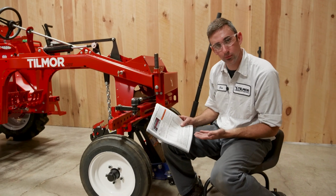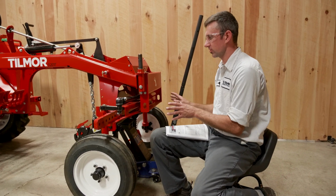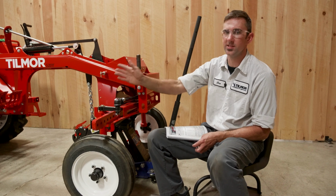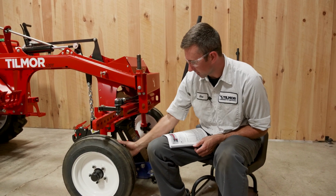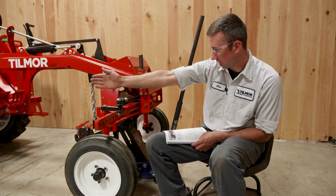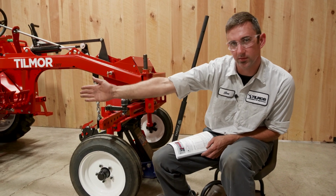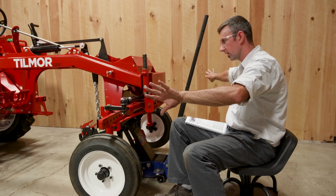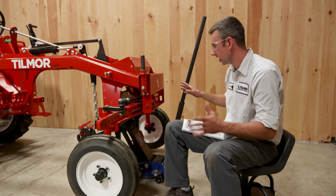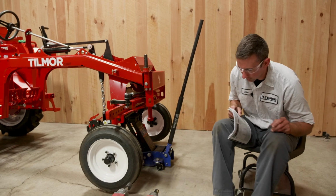As you're reading through this, you see there's 74 and there's 78. For the front axle, the very outside hole is good for the 74-inch rear spacing and the 78-inch rear spacing. The front is at 74. This front wheel rides on the inside of the wheel at 74-inch, and if this one's at 74, it rides on the outside of the wheel at 78 inches. So when these are clear wide and as wide as they go, they account for the 74 and the 78-inch rear spacing. After you've got it all set up and you know which spacing you're going to, and we know which hole does what, we will disassemble it and get to changing the spacing.